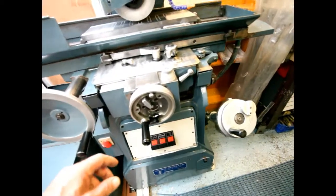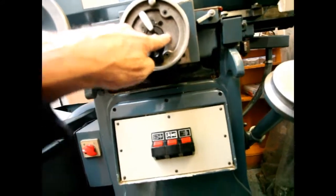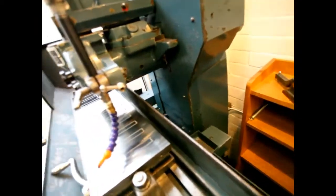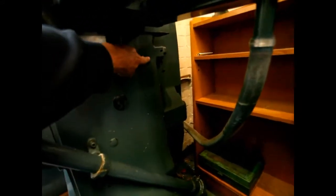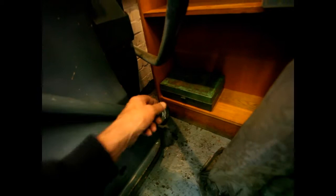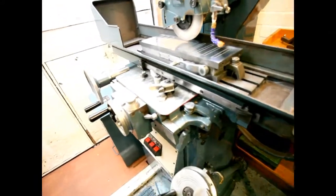Just a quick one on oil nipples: one in the middle, one on the side, one back here. This one's a bit tricky. There's another one at the top there, and it's going to be a bit difficult because there's no light round the back. If you look at the stud hole for the machine mount, it's directly above that - there's another oil nipple there. These are not grease, guys - hopefully you don't find that anybody's put grease in these things.